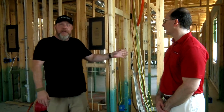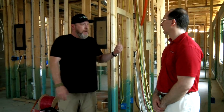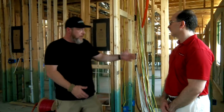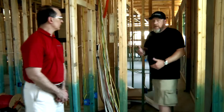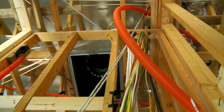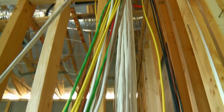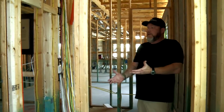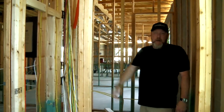Now, if Gene needs to hit any buttons, do anything to the equipment, all your manual controls are on the front. But also, we're going to have a door that opens up. In this room, we're going to have an AC return and a temperature control exhaust fan. And using natural convection, we're going to pull cooler air in from down below. The room will be relatively sealed, and that will then, using convection, take all the heat and suck it up and cool it down in the system.